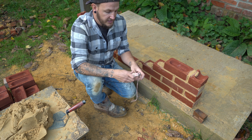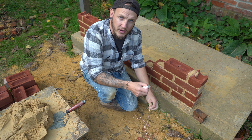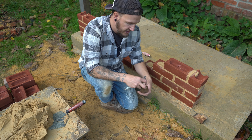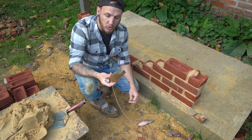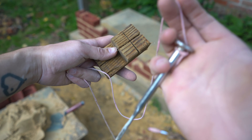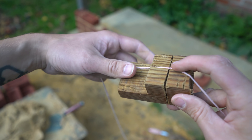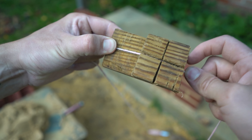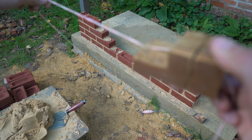The first thing we want to do is set up your lines. When you set your lines up you want them nice and tight — I'll show you in a minute the right way and the wrong way. First I'll show the wrong way because it makes life easier as a comparison. So you wrap them around the block. All blocks will look something similar — they'll have a notch cut through them. Put your string line through that little notch. This is the line that's going to be sitting along the brickwork.